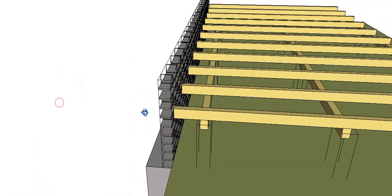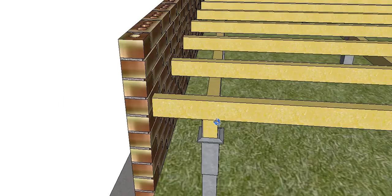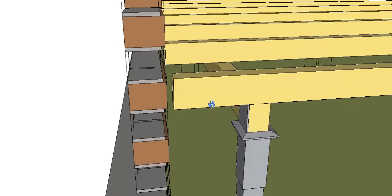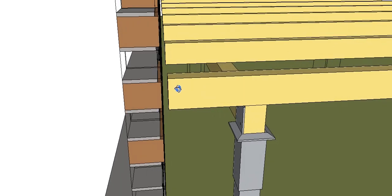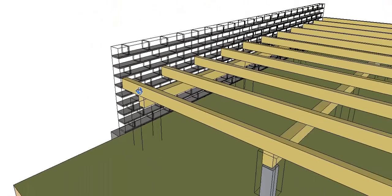As you can see here on this end, we had about a 400mm to 500mm cantilever allowable. This would only be a couple of hundred mil — maybe 300mm — so that's quite allowable. We make sure that they finish 25mm from the wall. It's not going to look bad because our actual decking boards can finish a little bit closer, but it just gives us that separation for termites.